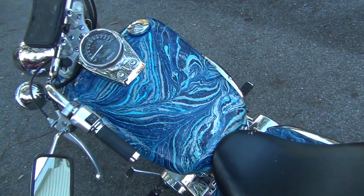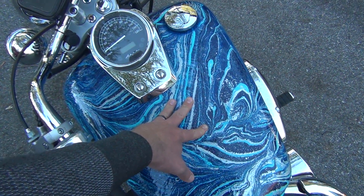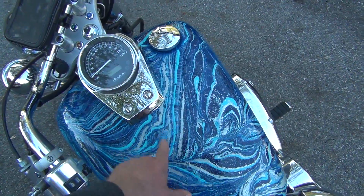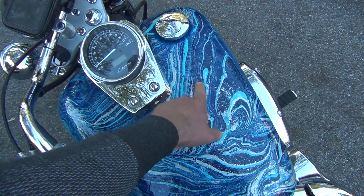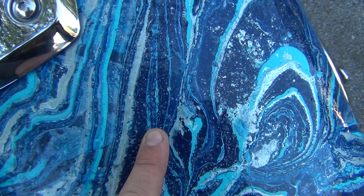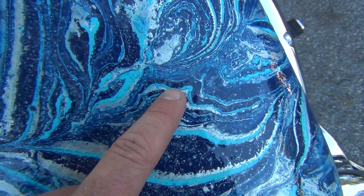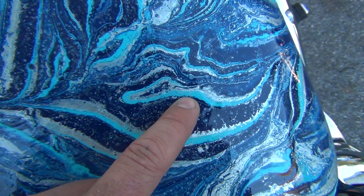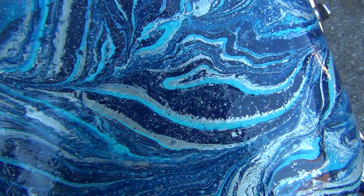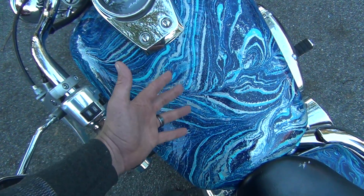Unless you have a lot of patience and are able to get out all the high spots somehow, you're just going to have to deal with it. The other thing is, because the paint is in layers and you're sloshing around in water, water will get in between the layers of paint — the different colors — and that's what creates these little indents. When you get up really close you can see all these little pinholes. They're not actual holes, but you can see all these little spots where water was trapped, and when it dries and the paint shrinks, it pushes the water out.